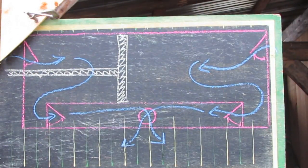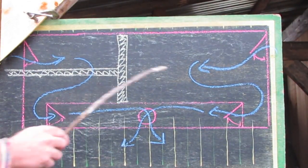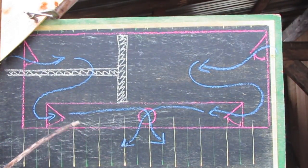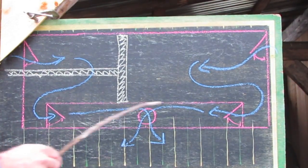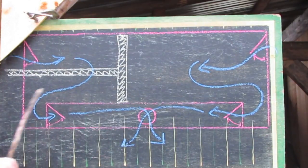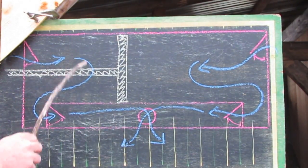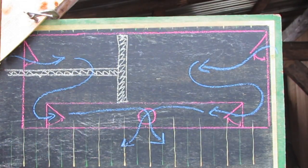So this is more of a Chinese style box bellows, in that instead of having the plenum as a separate box on the exterior, the plenum is contained inside the main piston chamber underneath the piston path. So it's basically the roof of the plenum becomes the floor that the piston rides on, and then there's valves on either end for the air to travel through. But otherwise, the principles are identical to a Japanese box bellows.